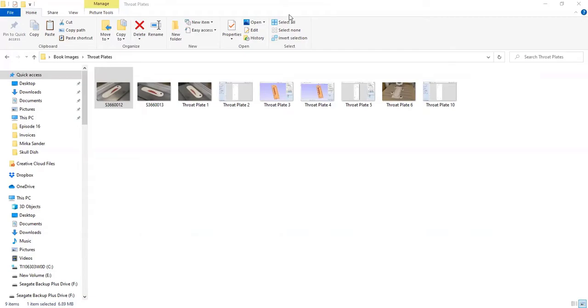Now notice this is upside down and backwards from the way it sits. There's your finger hole, and here's where the blade comes through on the left-hand side. But here, we're going to mill it from the underside for a couple of reasons. The main reason is for this slot here in black. If you've ever built a zero clearance insert for your table saw, the blade actually comes very close to the surface of the table saw. And if you use a 1/2-inch piece of plywood like we're doing here, it doesn't sit all the way flush. Your blade doesn't go down deep enough, and some people will put a smaller blade on to do that. But here with the CNC, we're going to cut that groove on the underside as a clearance to allow the blade to turn on and start spinning before you raise it up and make your zero clearance. So that's one thing that the CNC gives you.